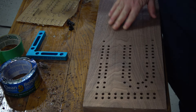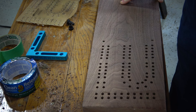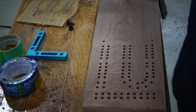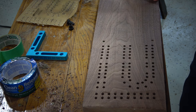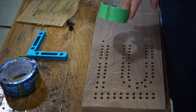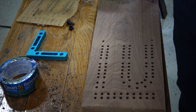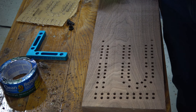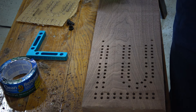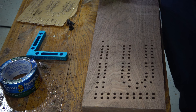As I mentioned, it was Sunday and Rockler was not open, so I consulted Google and went on to Reddit, where there were a couple of nice tips. They said use two layers of painter's tape, and also potentially scribe or center-punch your holes — not something I really want to do. But another tip said put the drill in reverse slowly to score your hole, then turn it forward, and that will help prevent tear-out. So I'm going to do both: put down two layers of painter's tape, go in reverse then forward at slow speed, and see if that eliminates the tear-out.